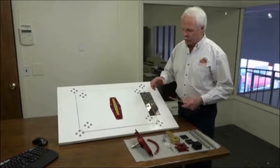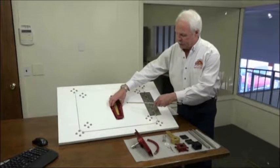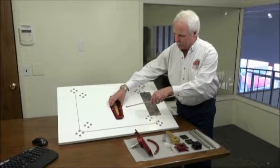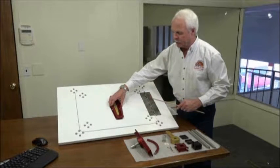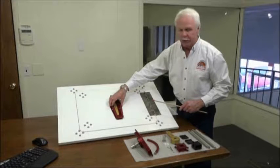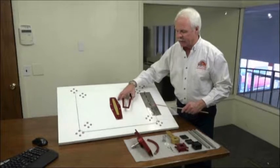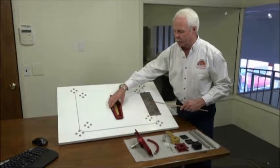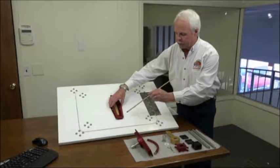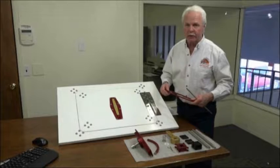The first step is to take the backer plate used for the housing and trace out the outer perimeter and the inside perimeter for a flush mount, so the housing would be recessed down into a cavity. If you're surface mounting, you only need to trace out the outer perimeter. Also, be sure to note the center locations for the eight fasteners, because those will be drilled out also.